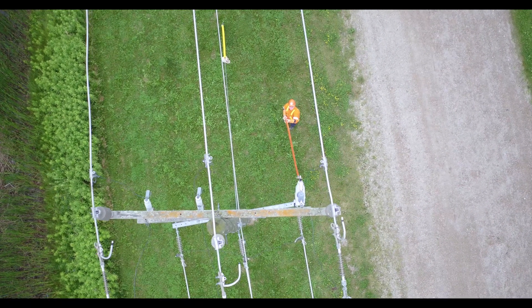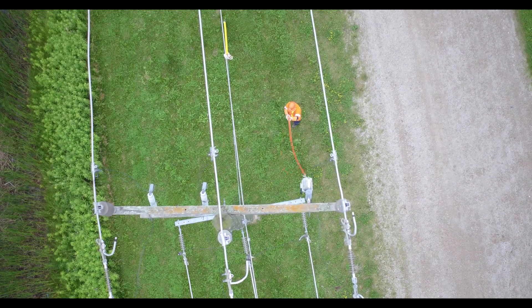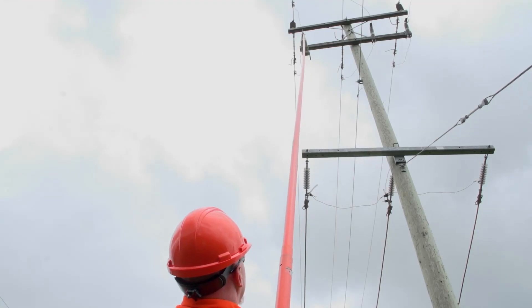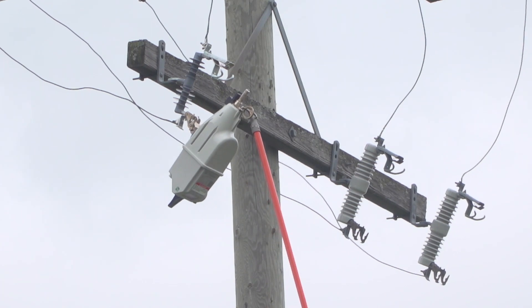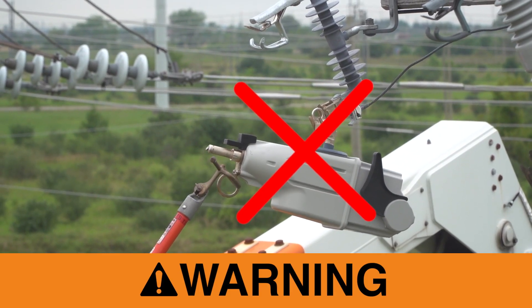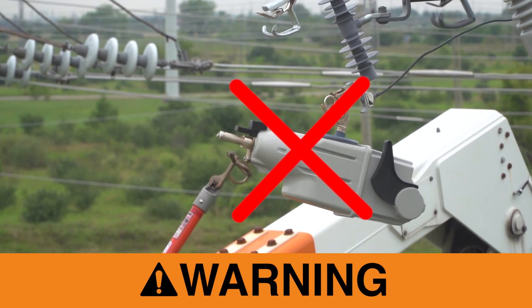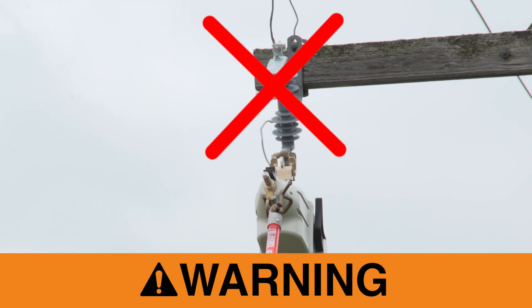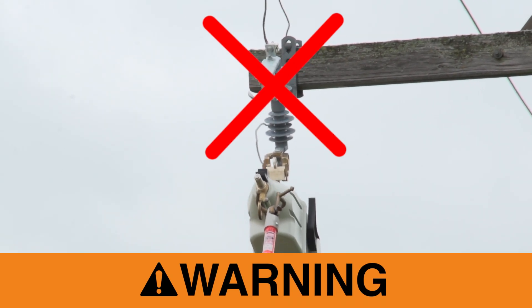When using an extendo stick, you should stand 6 to 10 feet from the pull and in line with the device. The procedure is the same: to avoid bounce back, maintain the forward force until the device properly closes and latches into the cutout mounting. Do not use the curled prong of an S&C talon handling tool to close a TripSaver 2 recloser. This can prevent full closure, resulting in arcing, equipment damage, serious injury or death.